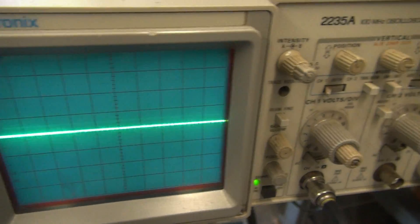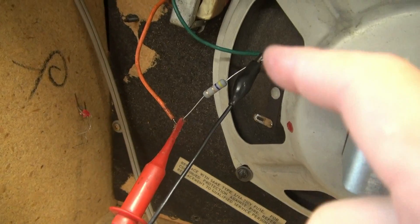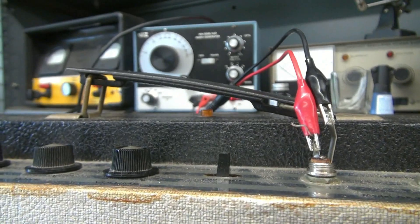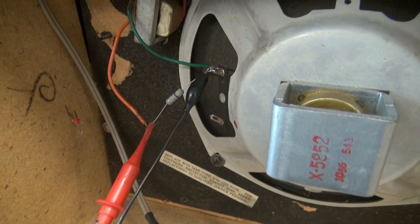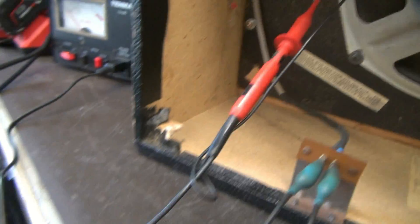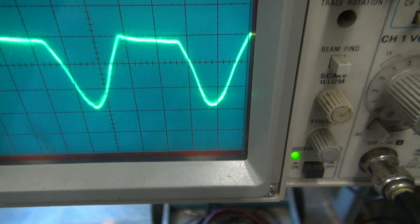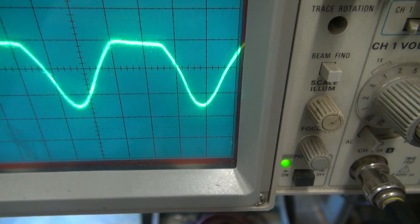For a wellness check, we're going to look at the output on the scope. What I did is I disconnected the speaker and put a 4.7-ohm resistor in its place. I'm going into it with an audio generator. I'll bring up the volume — you can't hear this, but we can see it. Let's take a look at the scope. Boy, does that look terrible — it's shaking, it's clipped. Nasty.